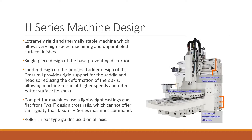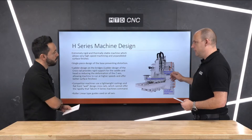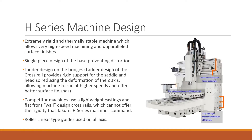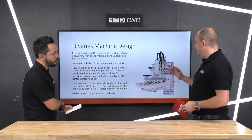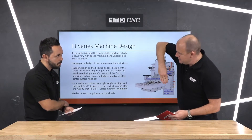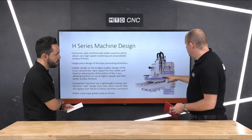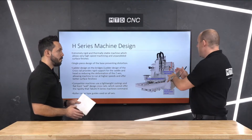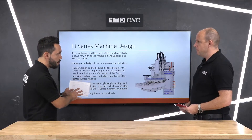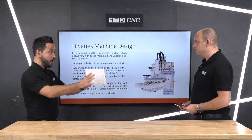You'll see on a machine like this where your spindle is moving left to right on the bridge — you'll notice you've got a guideway at the top and a guideway at the bottom. In a lot of machines these will be almost stacked on top of each other, essentially on the same flatness. Whereas here you've got a step ladder approach — this guideway is actually positioned in front of the other. What that means is as your X axis moves under the bridge, the spindle won't suffer with any potential movement in that direction. You can hit the machining environment harder, and the wear and tear is far better. So this step ladder is a USP from Takumi — not only are you getting rigidity in one axis, but in the X axis as well. In both axes you get ultimate rigidity.